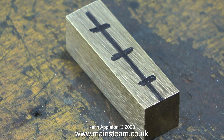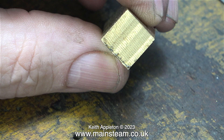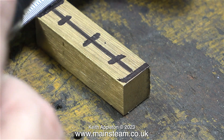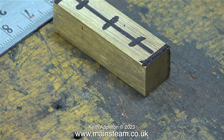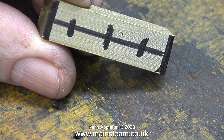Initially this is how I marked out the positions for the quarter-by-40 steam taps, and these measurements allow the steam taps to tighten up right next to each other. The first part of the machining job starts with facing the ends — the marks left by the saw that initially cut this piece of bar is not what I want to see. Using my felt-tipped deep-hole marker I'm drawing two lines, one at each end of the piece of bar, because I need to turn the end to make it look a little more decorative than just a block of brass.